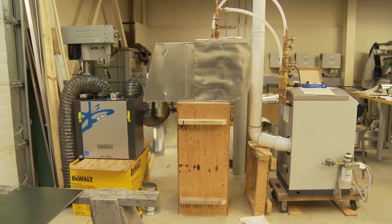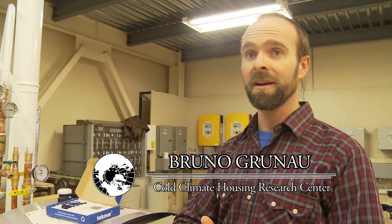We have a situation in the village where we want to integrate our ventilation. We want to make sure these people are getting fresh air and stay warm. We want to combine them because we don't want people turning the heat on and turning off the HRVs. If your HRV is on, you'll get airflow across the heat exchanger and a warm house. If the HRV is off, you're not going to get any heat in that house effectively.